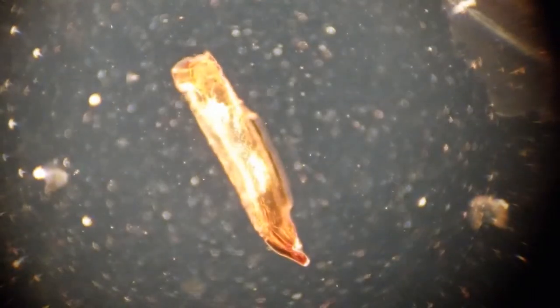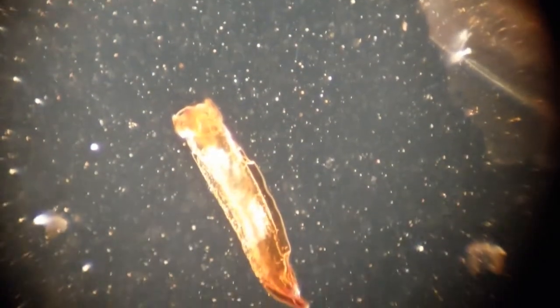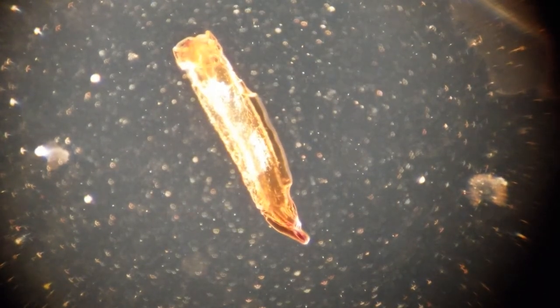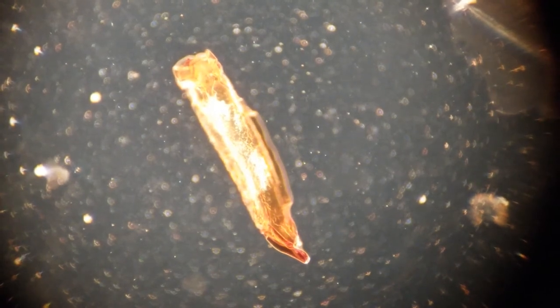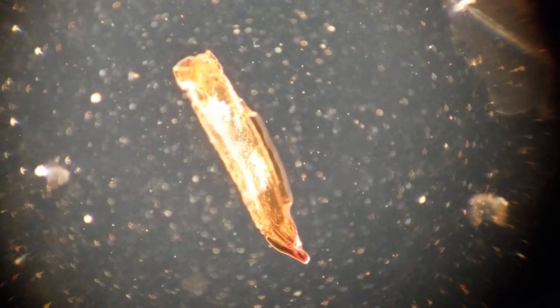All is not lost. So that is how I investigated some dust in the optical path, and after a lot of cleaning discovered that I had made a mistake in scratching the upper surface of the brightfield condenser. So I learned my lesson — use the proper techniques, be gentle, use q-tips. Using a thousand q-tips to clean the objectives or lens surfaces is still worth it, because a thousand q-tips are a couple of dollars. And in terms of the environment, a hundred dollar objective is probably a lot more environmentally unfriendly than a thousand q-tips. So be patient, use less force, and don't make the same mistake that I did.